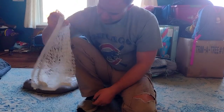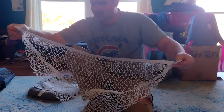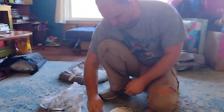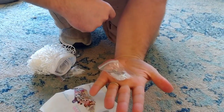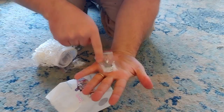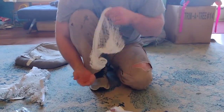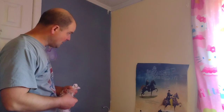You can see how big these are. You're going to use anchors, and then on either side of the corner this piece goes in the actual corner. Here are the anchors — you'll pre-drill your holes to put the anchor in for drywall. If you have a stud right there, you just screw directly into the stud. You get one little pack for each mount.